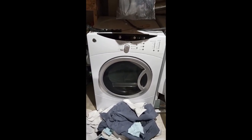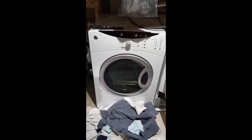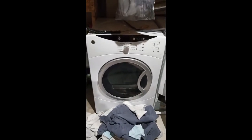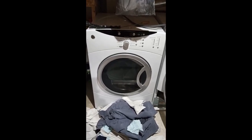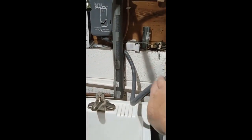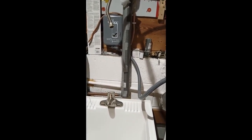A sagged heating element is a very likely common failure in an old dryer. If the cabinet is not grounded and somebody comes down here and touches that cabinet, they're dead. This is the electrical equipment — it's intended that you open a panel on the back, take a piece of Romex or armored cable, connect it to the terminals, and run it up to a box. The water heater here is hardwired from its enclosure through conduit to the little gray box — waterproof. That's electrical equipment wired into an electrical service installation, not a cord and plug.